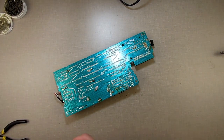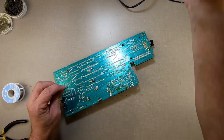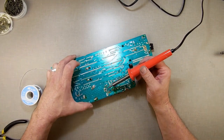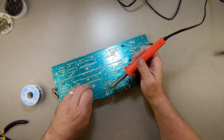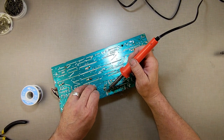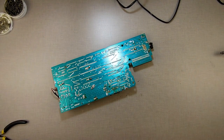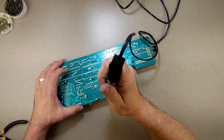Let's go back to the wires, let's get them loosened up. But I'm gonna get that off. Let me just see this. Those two are out. Am I hot enough yet? Those two are out, but this one just could use a little bit more solder in here. Yeah, it's weird that you have to add solder to remove it, but you have to give it something to purchase. And these over here have so much solder, they don't need no more added. But these over here...